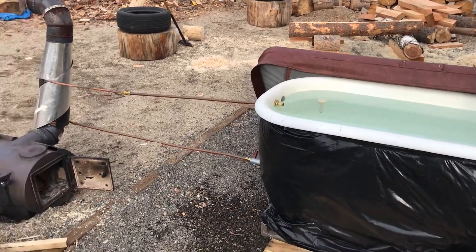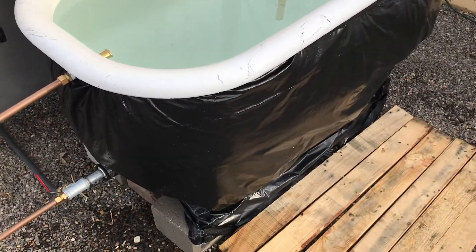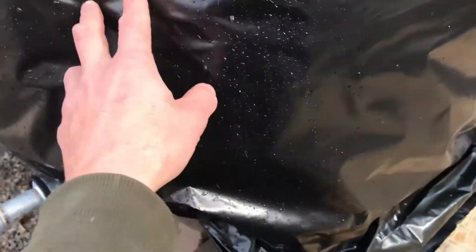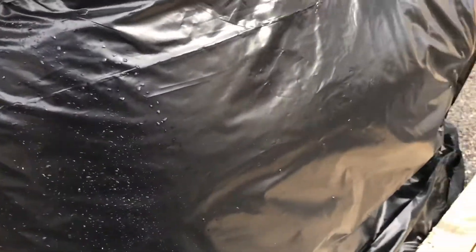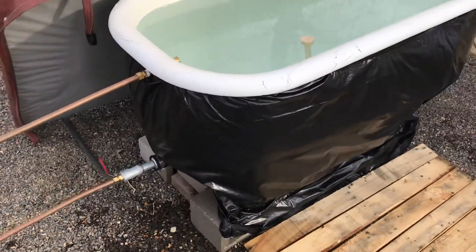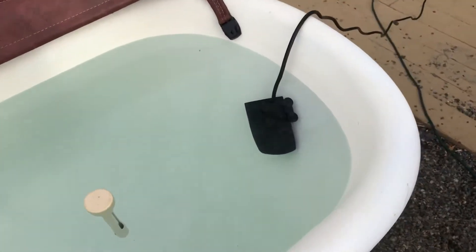What's going on YouTube — I want to show you my thermal siphon clawfoot bathtub. Got it all insulated; picked this tub up for free and just hot glued some R15 insulation that I had, then taped some six mil plastic over it. Since it's the middle of winter, that cast iron loses heat real good. Then I have a little pond pump in here to circulate the water, and that works awesome.